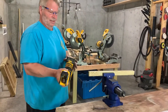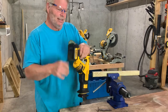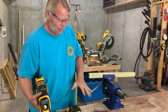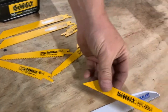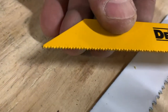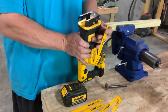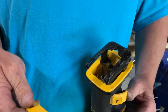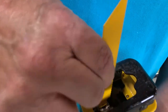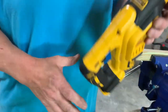Now we're going to take the battery-operated one. Same thing — I'm going to disconnect my battery before I change the blade. These blades come in different lengths and different sizes. This is a metal cutting blade, and you can see it's got really fine teeth. The more teeth it's got, the finer it's going to cut. This is for cutting metal. I'm going to put a metal cutting blade in here. On this battery-operated one put out by DeWalt, this is what holds your blade in place. I'm going to push that back, slide my blade in, let it go — it's locked in place. That simple.